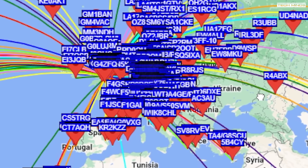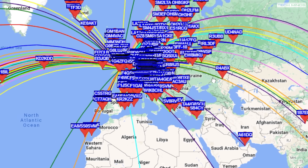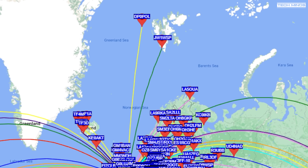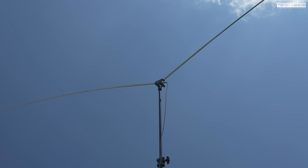So I decided to run WSPR for a few hours with a power level of only 5 watts from my Icom IC-7100. The results showed a huge cluster of stations receiving my WSPR signal around Western Europe, but also stations receiving me in Australia, Antarctica, Brazil, and the east and west coasts of the USA. There were even a couple of reports from the Arctic Circle. The antenna was pointing north-to-south with the broadside facing east-to-west.